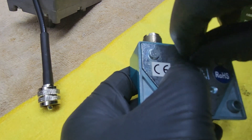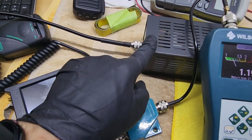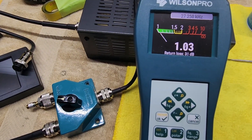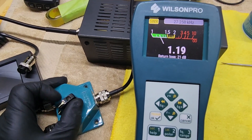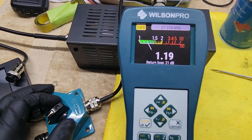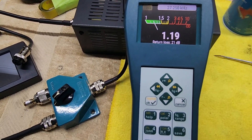I've got two dummy loads - one from the nano VNA which I was using for testing, and one for each side. Now this side reads 1.19 and the other is 1.03. This side is a little bit higher because of the three-foot cable and different dummy load. Bending that spring fixed it. I also used electrical contact cleaner to clean all the contact points. I'm gonna hook it up to the radios and do some tests with the Quad 6 Pro and regular Quad 6. It works - 73!